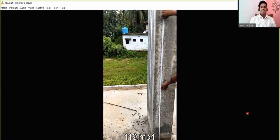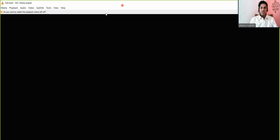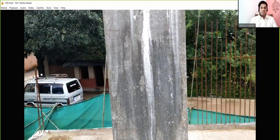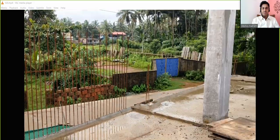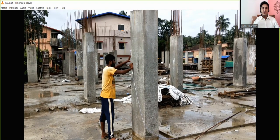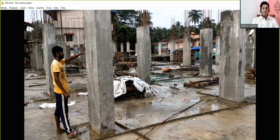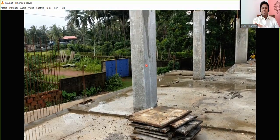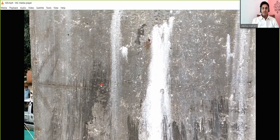Practically, you can see this worker doing that 5-feet marking on one column — exactly 5 feet. Now this is the 5-feet marking done on one column. With reference to that column, we are marking all the others. You can see the level has been transferred to several columns already, and now this worker is transferring it to the next column. This method of transferring with tube level was already explained at the time of plinth level.